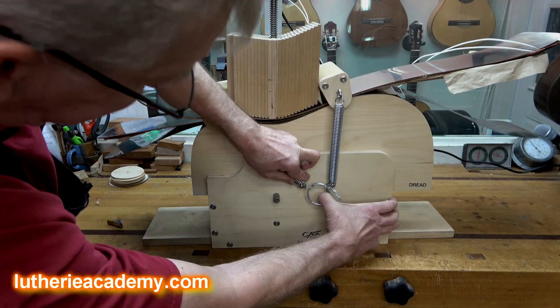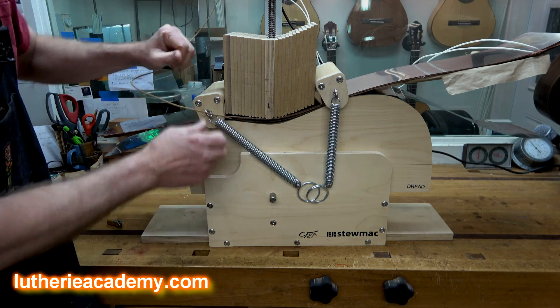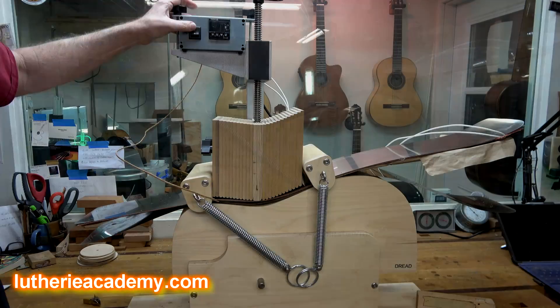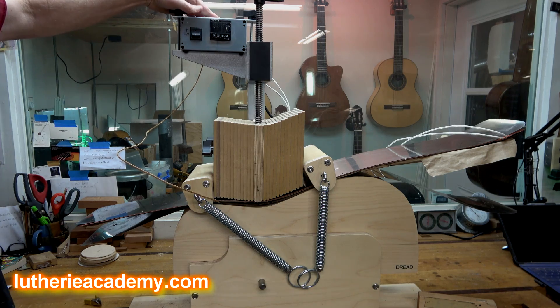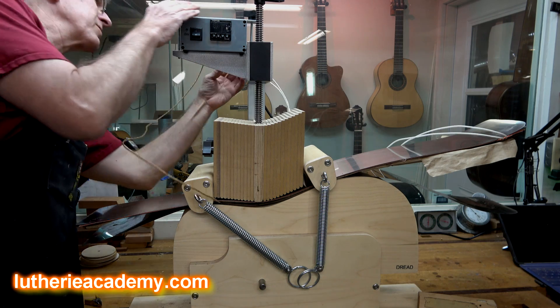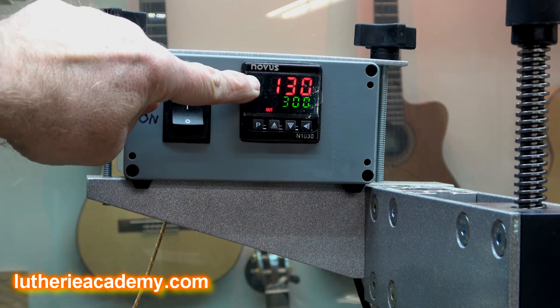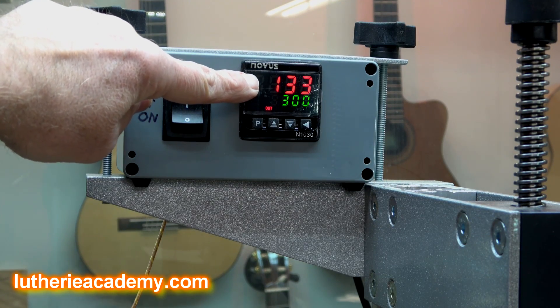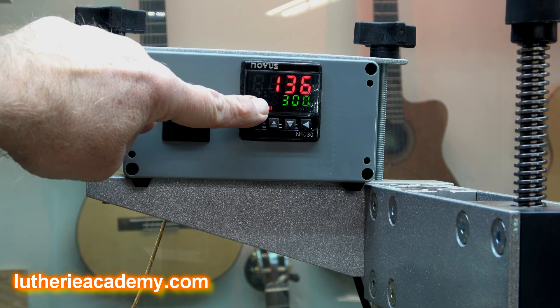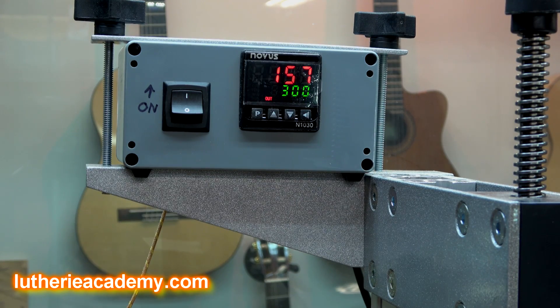Be careful not to ricochet the arm into yourself. It's also good to clamp the machine to the bench so that when you're pulling, it's not moving back and forth. There are two switches — one on the back and one on the front — and you want to make sure both of them are on; that's a safety feature. I've got my temperature set to 300. The red temperature climbs very quickly — that's your blanket temperature — and the green is what you've actually set your target bending temperature to. Make sure you don't turn your back on the bender. Anytime you have a heat source in your shop, don't go check your email or answer phone calls. Pay attention to what you're doing.